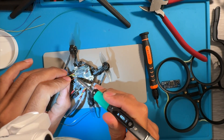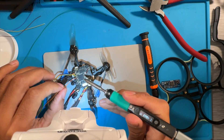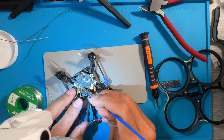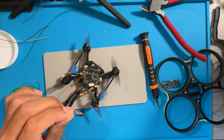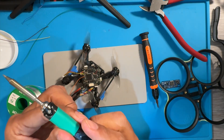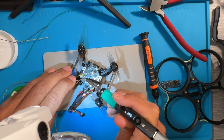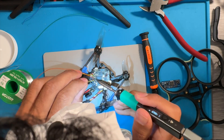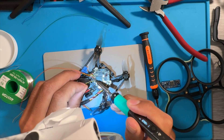As you can see, everything's done on this end. When it came to putting solder at the points that need to be soldered on the flight controller, it's a little tricky. That's why I need that magnifying thing on my head. With the magnifying glasses on, everything just looks 3D-ish and you gain the confidence and are totally capable of doing it. You have the ground, then you have the R1 and the T1, and then the power. The 5 volts — you want to make sure you attach it to the 5 volts and not the 9 volts. But it's straightforward because I'll leave a link in the description below.